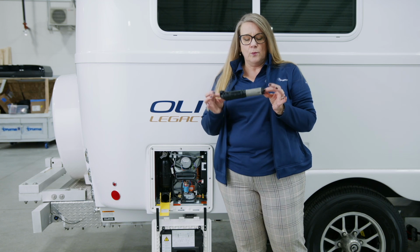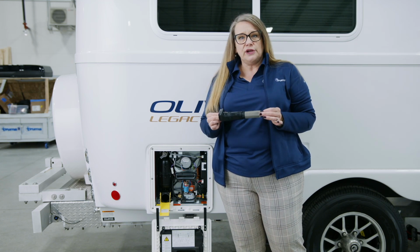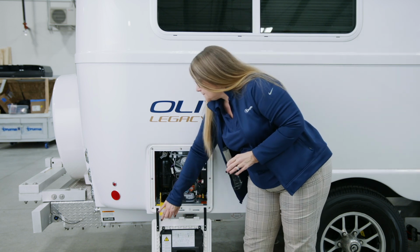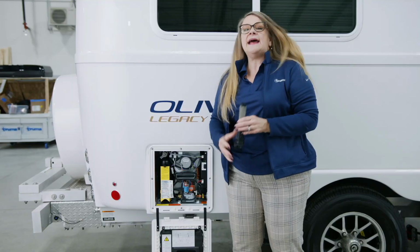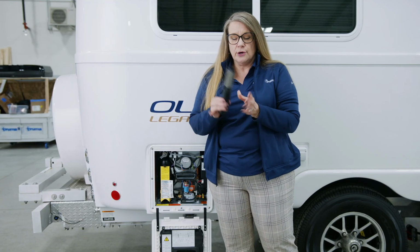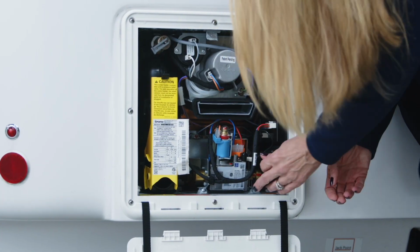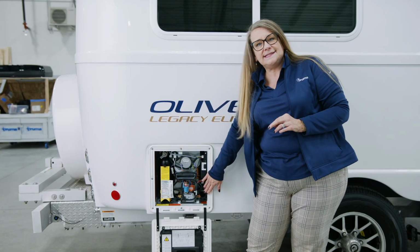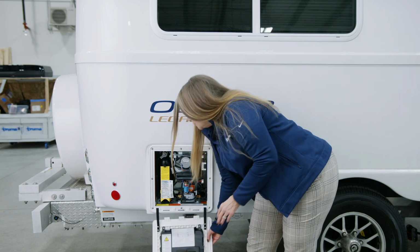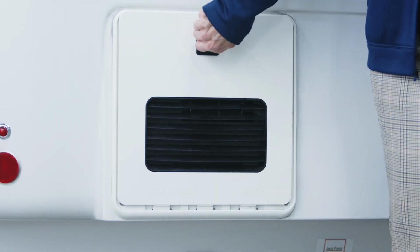And then once the system is drained, if you want to store the unit for winter with the system drained, leave this filter removed, snap the Easy Drain lever back in place, and it is that simple. So the filter cartridge slides nicely in this spot here below the circuit board on the AquaGo. And then if you put your door back in place, and you're on your way.